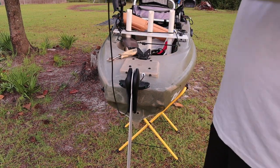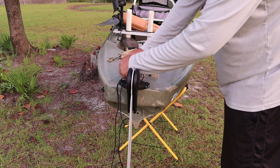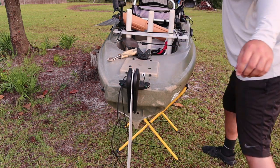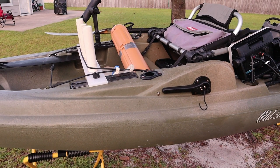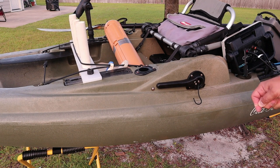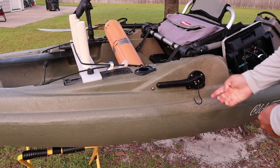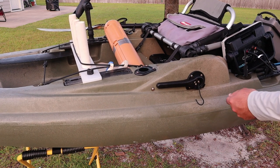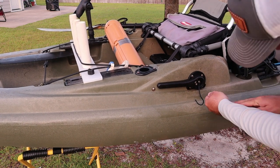Now we have our wire and our rope attached. We're going to come up here — pull slowly. You want to make sure you get this started as smooth as possible. Once it gets started, you're going to feel a bunch of friction but you're just going to move slowly. Pull on this nice and slow. If you get hung up anywhere you want to stop — you don't want to keep pulling too hard. The goal is just to pull on it a little at a time. If you break it off in there it'll be a pain. It'll get a little stiff — that's it feeding through the pulley system. Just nice and slow, give it some wiggles. She's right there — getting close.